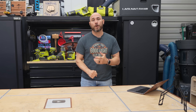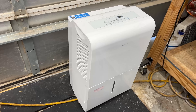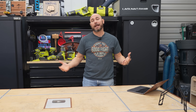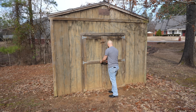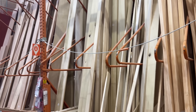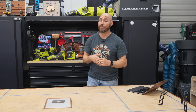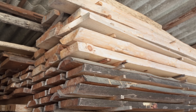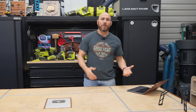Number five: avoid storing your lumber in a damp or humid environment. Sometimes that can't be avoided, especially if you live in the south, but adding a dehumidifier really helps, or just keeping the garage door shut. For storage sheds, try to keep everything up off the ground and covered so it's not damp or wet. My local lumber store stores all their lumber outside but covered. If it's really pouring rain, I try to avoid getting lumber from there for a day or two after so it can dry out.